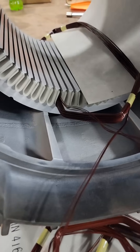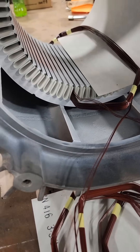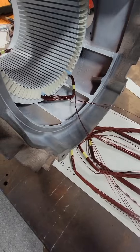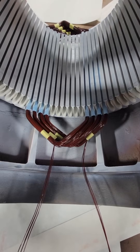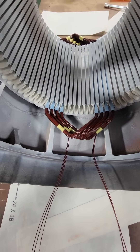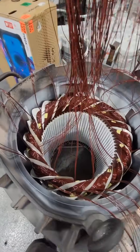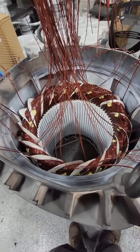We use the same paper that we use to line the slots — a Nomex-Mylar-Nomex paper — as scuff paper, and that can help us guide one side of the coil in while the other side will be hand-fed a few wires at a time. Each group has two conductor sets coming off of it — that's our start and end of that one group. So at the end of this with our 18 groups we're going to have 36 coil ends that ultimately come out as six.